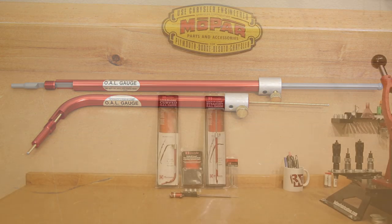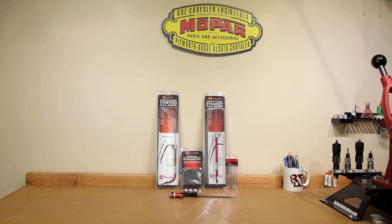This tool can be used for sorting bullets, helping you get your bullet seating die set properly, or repeat a previous seating depth, as well as — its most important function in my opinion — helping you locate the bullet's ogive relative to the rifling in your barrel. I prefer to call that the distance to your rifling for your specific projectile. Before we get too deep, let's start by going over this tool, or really tools, because they're commonly used together.